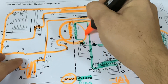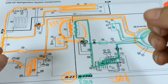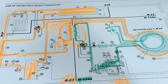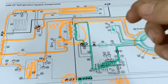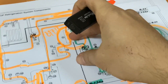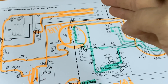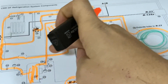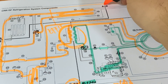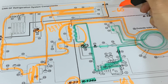From this heat exchanger, the efficiency will be so high that they both help each other to condense and to evaporate each refrigerant. To repeat: the evaporator of the high temperature stage system cools the condenser of the low temperature stage system through a special plate — the heat exchanger. The condenser of the high temperature stage system then transfers the cargo heat to the ambient air. The evaporator of the low temperature stage system cools the cargo, achieving the cargo temperature down to minus 60 degrees.